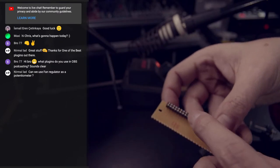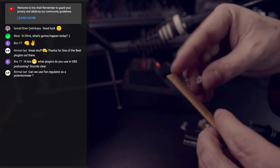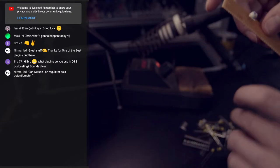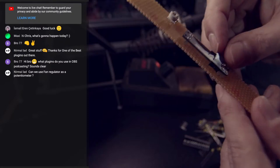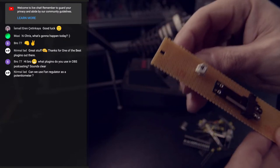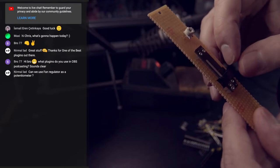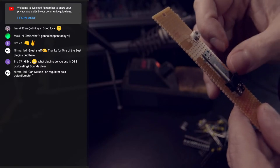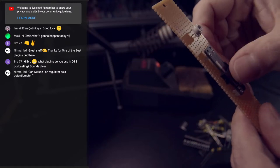We're going to put this stuff in and then design ways of patching little cables right into here. And we've got lots of trim pots. Same deal as with the slider: if we build the slider into a circuit like this, we can just glue some kind of thing on top of this, like another piece of perf board, to cover over enough of it. And we can actually use colored electrical tape to give a nice, bright, resilient color that's not going to wear off with use. On the piece that we glue to the top of this, we can also snip off this bit on the side and have it be a moving slider that adjusts things in the circuit.